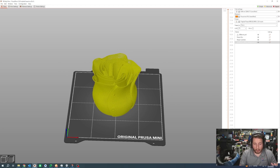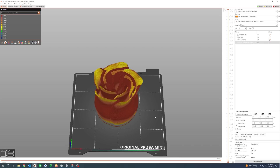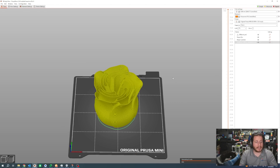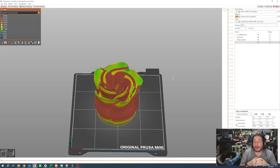This only gets worse when you start looking at bigger parts. Here's another example: the vase mode rose — link to that in the description. This thing is an hour and 15 minutes with your standard 0.8mm nozzle limited to about 18 cubic millimeters a second. When we go up to 28 cubic millimeters a second, which is where high flow should generally land us, we go from an hour and 15 minutes down to an hour and two. That is a 13-minute savings — over 20% — which is a lot of time, especially when you're running something like a production environment.